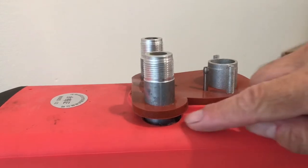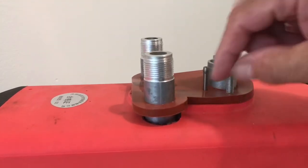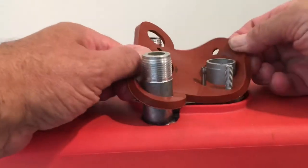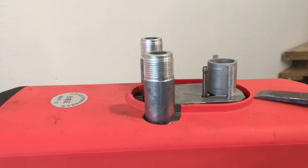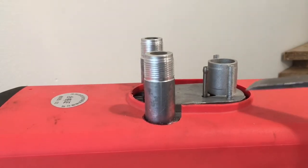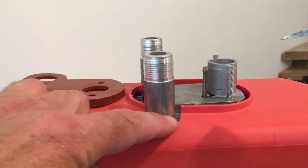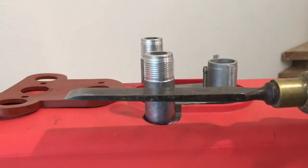So what I'm thinking the best thing to do, because when the air blows in one side and out the other side, the air will blow out of here because this cover is supposed to be sealed. So basically, what I think is the best option, just take that off. There you go. I think it'd be better if I took this lip off all the way around, and the same on this side here, trimmed it back, and then at least this seal will sit flush to the base. And if there is a little bit of a gap here and there, well, I can maybe shove a little bit of mastic or something like that in there. And then we'll have a tight seal. And then the base plate can be fitted on top.